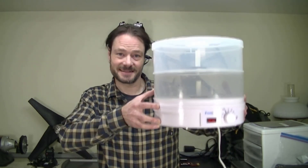Specifically, today's video is about what the hell is going on with this. In a previous video, I spent a lot of time going on and on about adding liquid cooling to my 3D printer. The purpose of that was to try to improve its printing of high performance filaments like nylon. As many of you know, nylon is notoriously hygroscopic and will become useless if exposed to air for even just 12 hours. So drying it before printing and keeping it dry is really critical to success in using it.